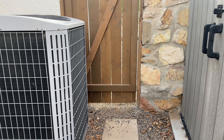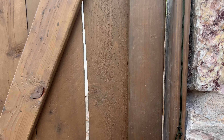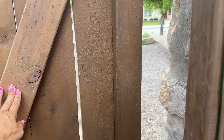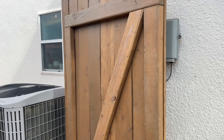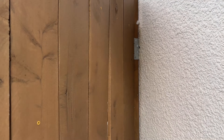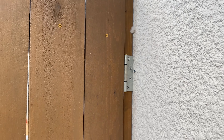Here's the second door — this one has a little more gaps in it. He also put the pulley system here. Quick tip: when you buy cedar panels at the store, lay them on the floor and align them the way you want so you can make sure there are no gaps and they're symmetrical. On this side of the house he found a stud in the wall, so the weight bearing is on the wall this time.